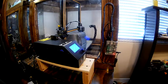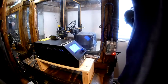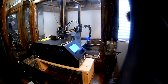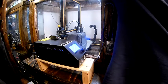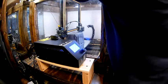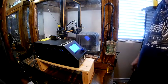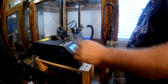Hey guys, I thought I'd do a video on changing my filament on my CR-10. It has the new Marlin firmware on it, and I'm into a 68-hour print. I'm going to get this new roll up here and get it situated. The new Marlin firmware has an option on it to change filament, so I'm going to do that here in just a minute and then get it swapped out with a new one. Let's try it out and see how it works.